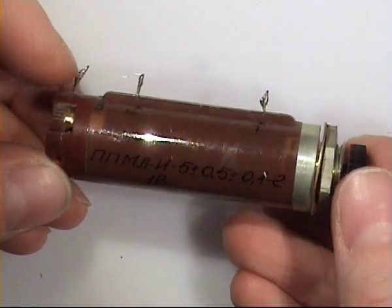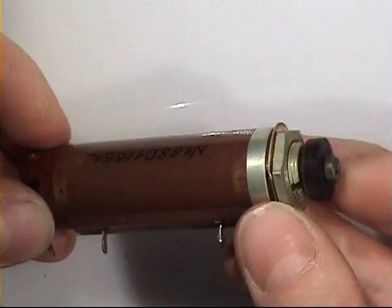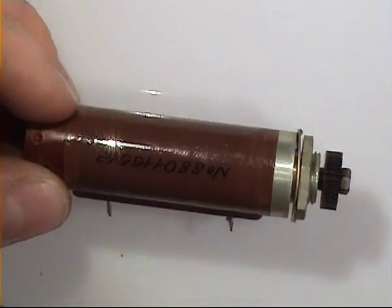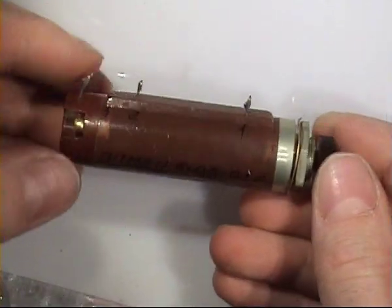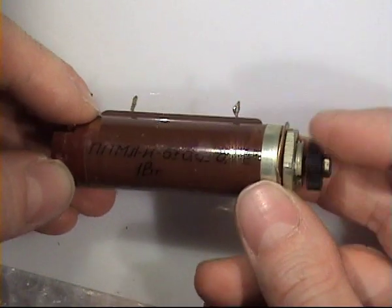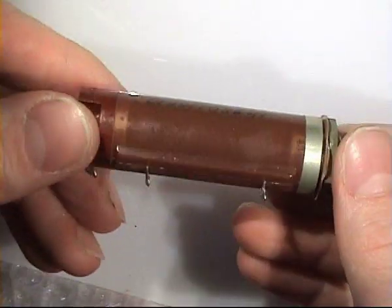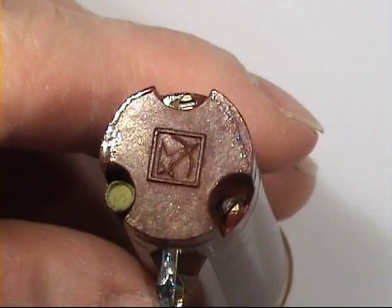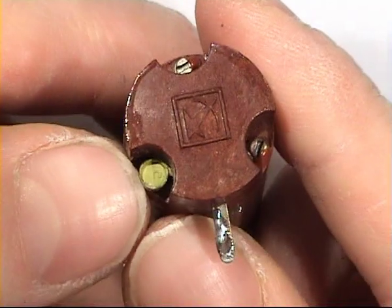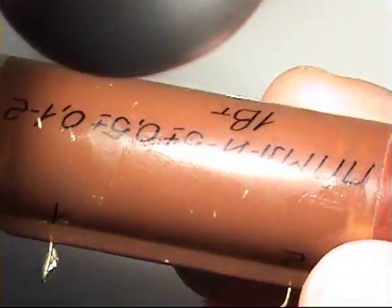This one is a very high quality multi-turn potentiometer. I believe there is a helicoidal track inside — you can do many many turns on it. It is the kind of stuff you will have in precision aircraft instruments, like a gyroscope. It is rated 1 watt. Very pretty. Here you have a neat logo of the manufacturer. It can be taken apart, but there is a factory seal on one screw. You can almost guess the internals.